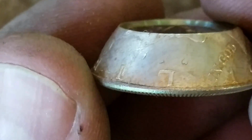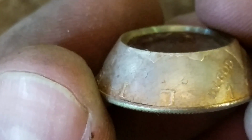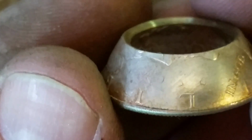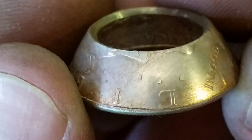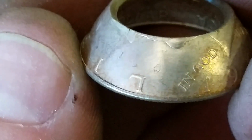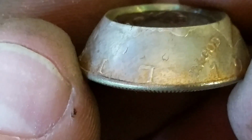Okay, check this out. So this last annealing I got a little too aggressive on it. It didn't look like it from the video, but you can start to see just a tiny bit of delamination there, little problems on the surface. It looks to me like there's little miniature layers of the silver here. You'd think it's homogeneous, but I think it's layered some way, and it starts to split off from the layer underneath and creates these little tiny problems. That's just barely becoming a problem.